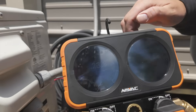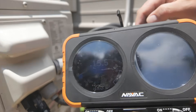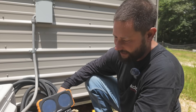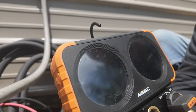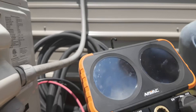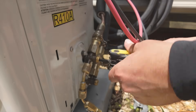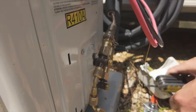We should see our gauge and our pressure dropping. You can see the gauge and the pressure dropping — it says 20, 15, 10, 9, 8, 7, 0. When it gets near zero or at zero, close your other valve because all of the refrigerant has been pumped inside the outdoor unit.